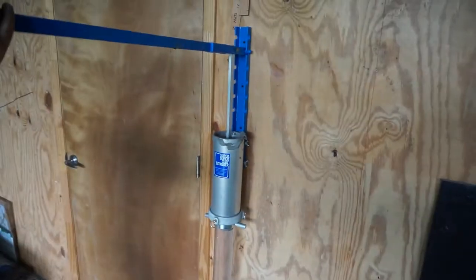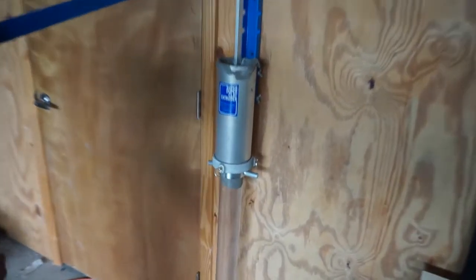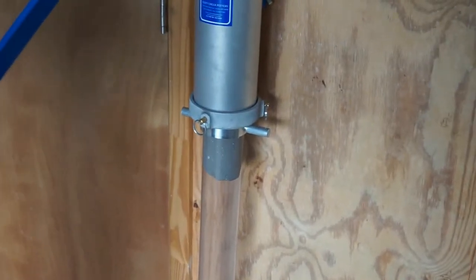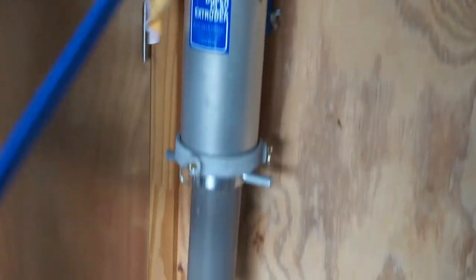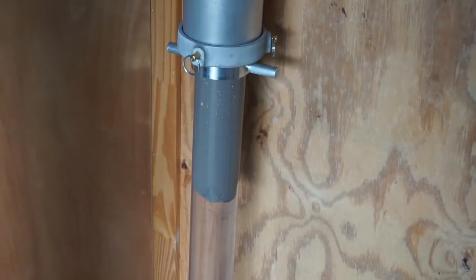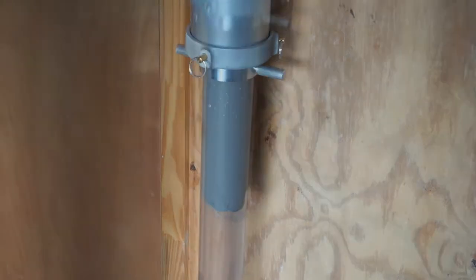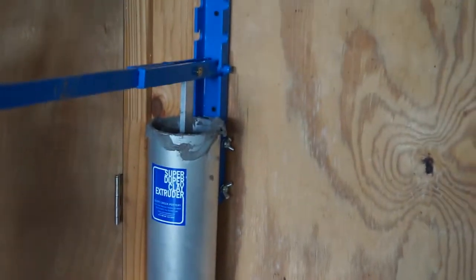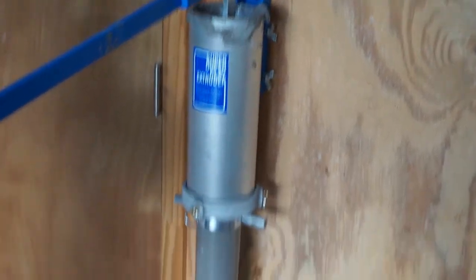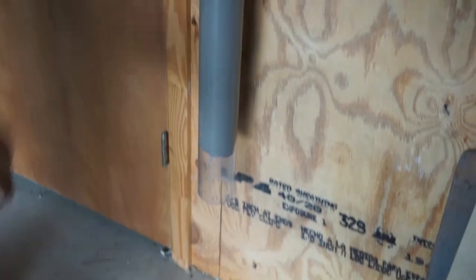We typically use bag clay, adding about 10 to 15 ounces of water into the clay prior to loading the extruder. It's then a simple process of loading a sausage of clay into the extruder, trying to eliminate as much air as possible before extruding down into the polycarbonate tube.